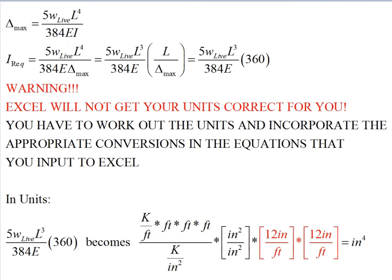The maximum deflection for a simple span beam is δ_max = 5WL⁴ / 384EI, where L is the length of the beam. This is a very sensitive dependence — L to the fourth — so you don't have to increase the length by very much to have really drastic effects on delta. E is the material stiffness in kips per square inch, and I is the moment of inertia of the cross section in inches to the fourth.